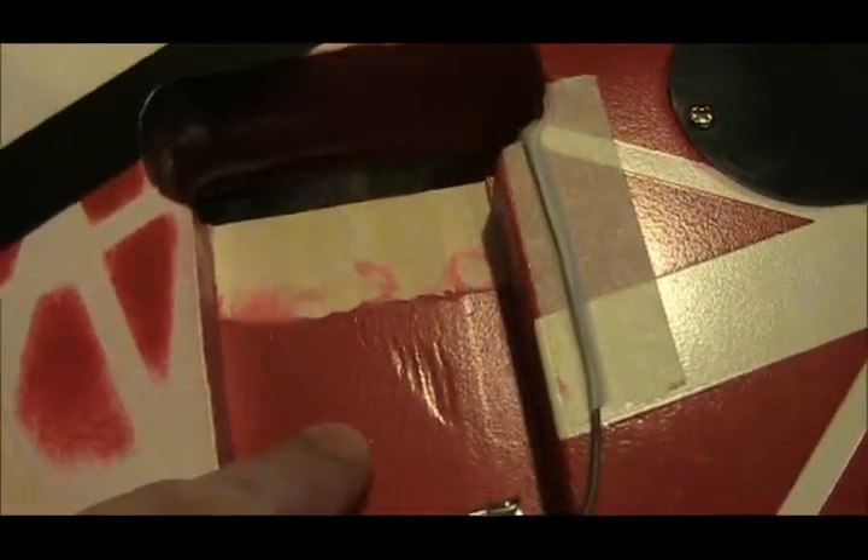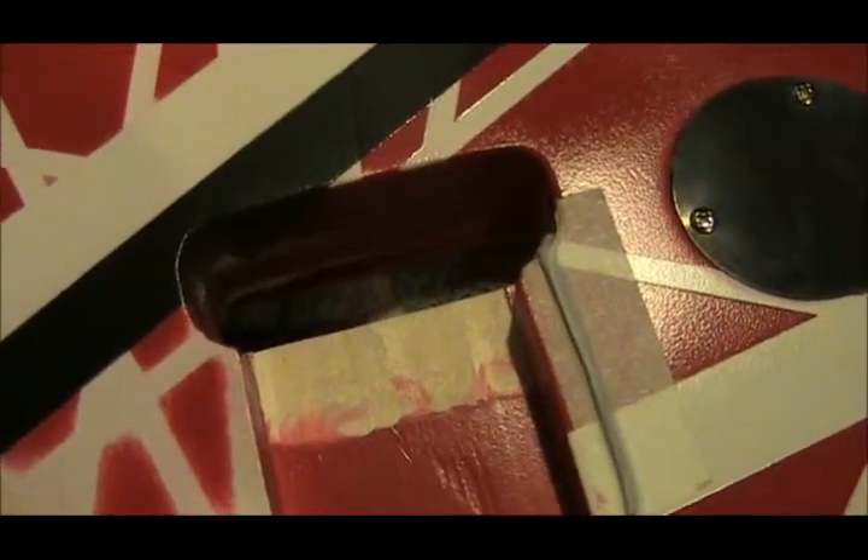The line is reasonably straight — could just be the jig flexing under the weight of the router — but I got a good clean cut. It didn't go very deep so it's probably not deep enough, so I'm going to plunge the router another sixteenth of an inch or so. That'll bring this line back probably to here. As long as it only goes back about that far it won't look bad and it's not going to get in the way. Jig works — I'll just finish this up, put it back together, and then paint. Actually I'll put it together first to make sure it's not rubbing before I paint.